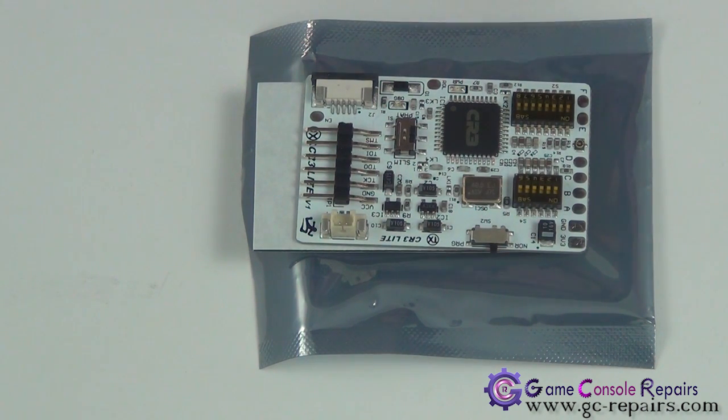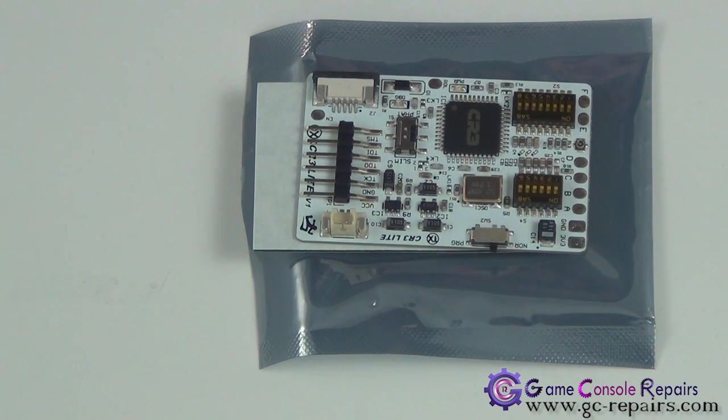With the Corona model, there are quite a few things to go through. First, if you are 100% sure your soldering is accurate, these are the possible scenarios when you solder your Executor CR3 Lite onto your Corona motherboard. The first scenario: if your console boots up on the first go, stick with that setting. The second scenario: if the Cool Runner doesn't glitch and stays red, you need at least one setting on your S2 switch.